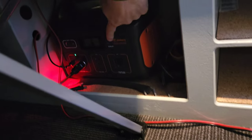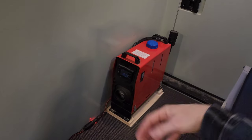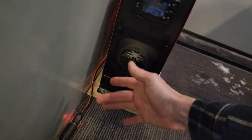Right now everything's running off this Jackery power bank. We are drawing 12 watts. That'll go up to just over a hundred watts when the heater fires up — there's a glow plug that takes a fair bit of energy and then the fan runs at full speed. This is at the lowest setting, with some nice warm air coming out.